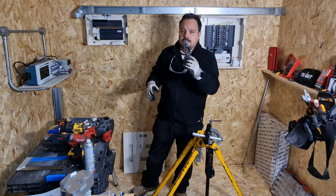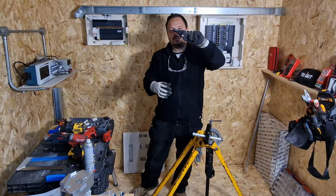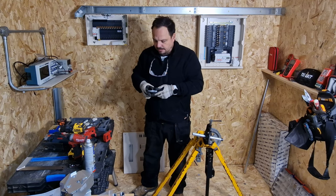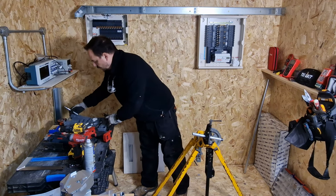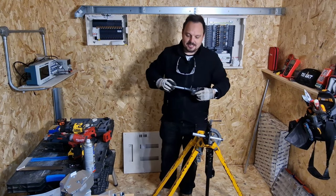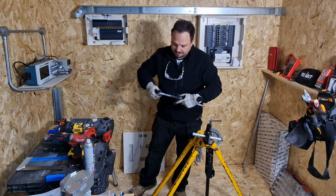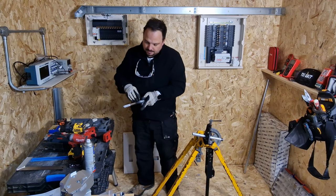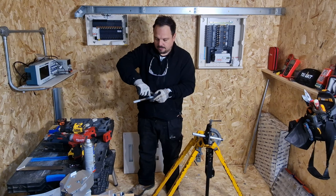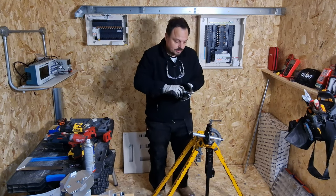Your threading tool has a main base plate. You then want to insert the right size tube hole - this is the 20mm fitting that goes in the base to protrude out of this end, so that's where the tube is going to insert. You then want to put your die on - make sure you get the 20mm die with the right cutting thread. There are variations; this is an F4P set I've had for quite a while. Put your arms into each end as well - this allows you some leverage while working on the tube. Then finally, the holders - this just clamps the threading part of the tool into place so it's not moving around. You need to make sure that's square and firmly held in position.